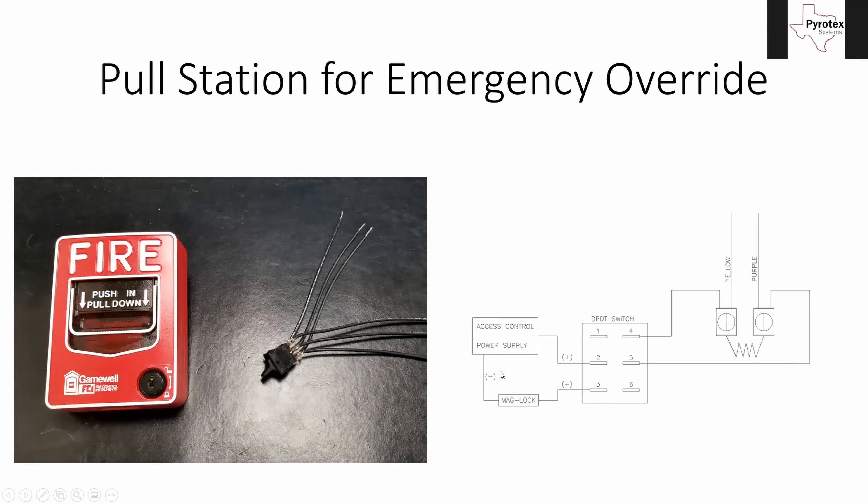The pull station will still activate the fire alarm like normal. The other side is for releasing the electronic lock — the access control power supply has your negative power leg coming down to the lock, and the positive wire is broken in this switch. In its normal position, terminals one and two are open, as well as four and five. Electricity comes in down the yellow, stops at the open contact, hits the end-of-line resistor, crosses it, and returns up the purple leg, completing the circuit and showing normal condition. Meanwhile, terminals two and three — as well as five and six — are your closed contacts, so power comes in, crosses the closed contact to power up the lock and returns up the negative side. Everything is working normally: your lock is on and your alarm is off.